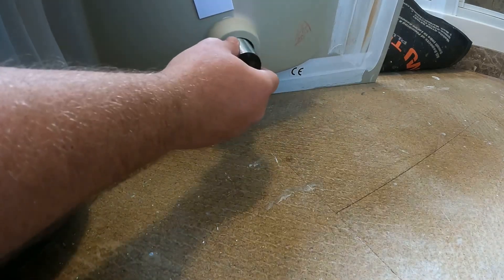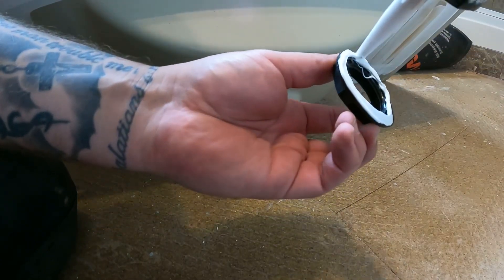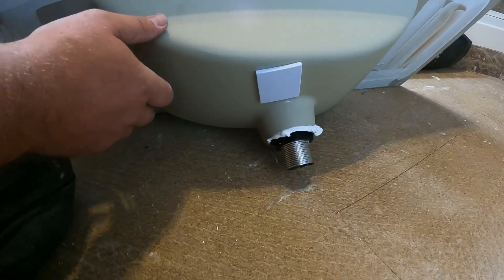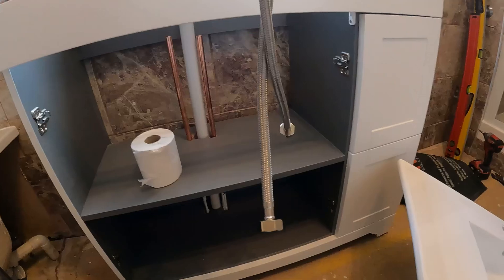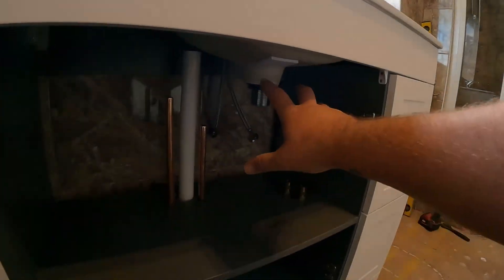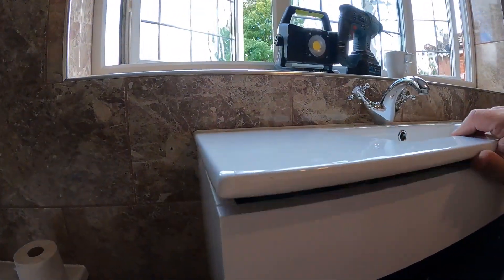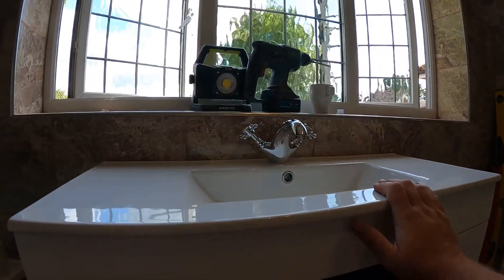Just put a little bead around the waste where it comes out, pop it in, put another bead around there, then always put a little bit around the nut and screw it into position. Get that wiped off, get that tightened up, and that's the waste done. We've got the mixer tap here with the flexes into the bottom of it — the tap is going to sit about there so we'll be able to connect onto the pipes no problem at all. Let's get this made into the basin and lift it up into position. The basin is lifting into position now — taps made in, waste made in, pipe work ready to be connected on to the flexes. It doesn't come with any brackets to hold it into position so I'll put a little bead of silicon around the outside edge where it sits down. It's fairly heavy anyway, and when we seal down the back of it it's going to be fixed into place solid.